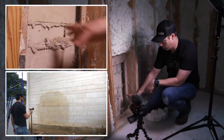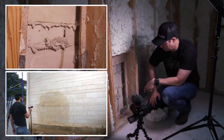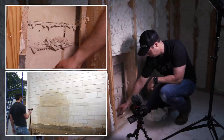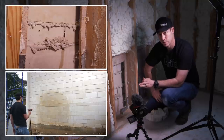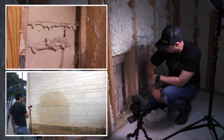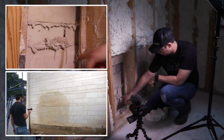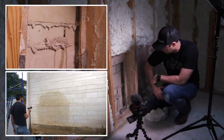Typically when we remodel, we find the most damage in the bottom one to two feet. When we've got OSB, an inferior house wrap, and all wood framing, these are sensitive materials and we have to be really cautious. We're seeing even more come through now — it's not just that pocket, but it's coming through in other areas as well.